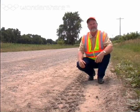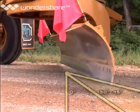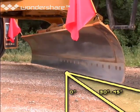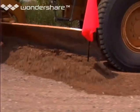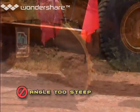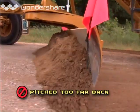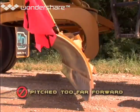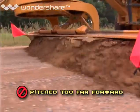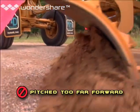When reshaping the road, the orientation of your moldboard to the road surface is critical. First, you need the correct angle — somewhere between 30 and 45 degrees. Too little angle will allow material to spill from the leading edge of the moldboard, called the toe. Too much angle and you won't be able to blend and move the material properly. You also have to adjust the pitch or tilt of your moldboard. If it's pitched back too far, material will build up in front of the moldboard instead of what you want, which is material moving down and discharging at the heel or trailing end of the blade. And if the moldboard is pitched too far forward, the material doesn't roll across the face of the blade and won't mix. This pitch also doesn't allow the blade to cut into a hard surface, so you won't be able to trim out little depressions to reshape the road.